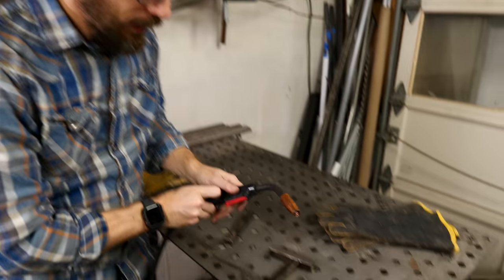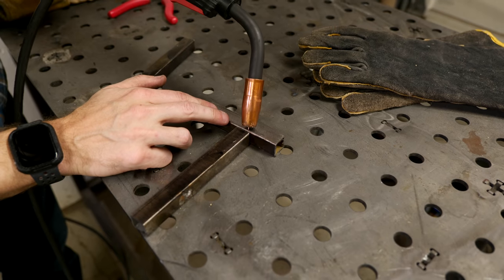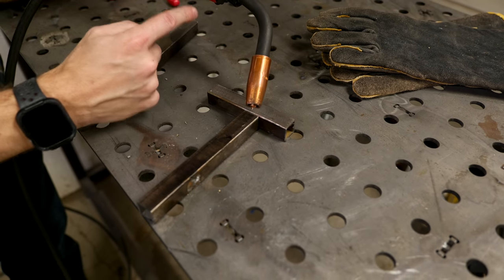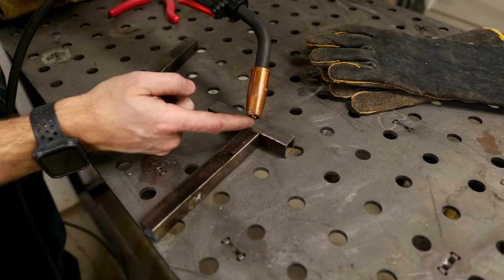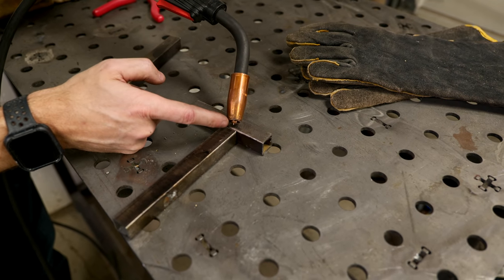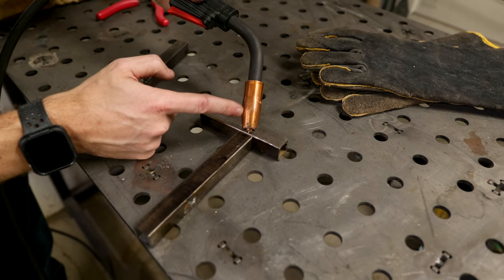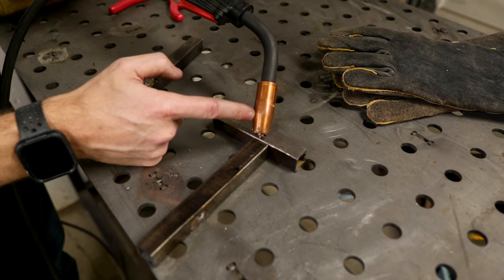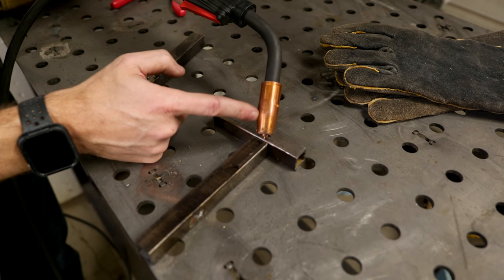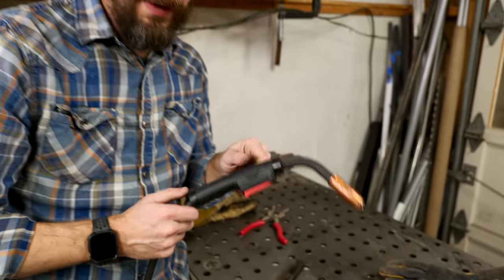Once you've got the machine turned on, the wire fed, the gas on, all that stuff, then it's time to actually start welding. You're going to put this piece down here. If we're going to weld that joint right there, you want to start straight up and down and then roll over maybe 10 or 15 degrees — it's all dependent on the particular weld you're doing. As soon as you start pressing the trigger, you're going to arc from this point down to the metal, so you don't want it to be touching — you want it to be off a little bit. An arc will be created and you're going to start moving it back, and the pattern at which you move it depends on the pattern of the final weld. I do a little kind of back and forth, little C shapes, but there's all sorts of different variations.